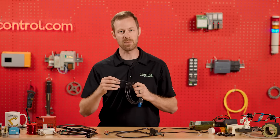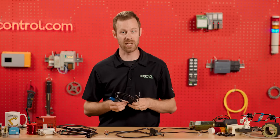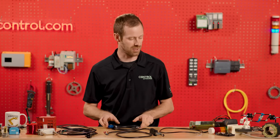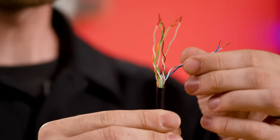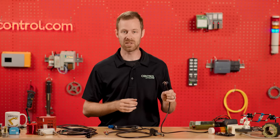That white wire is sometimes used for determining the output polarity, or for teaching the sensor a certain configuration. So we have to be very careful when looking up configurations for wires. In some other cases, like a networking cable, we see far more wires and they come in pairs. This is called a twisted pair connection, and it reduces some of the interference found in wires.